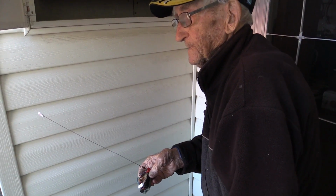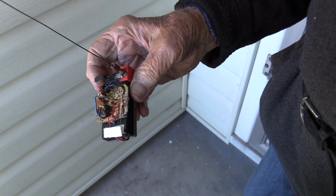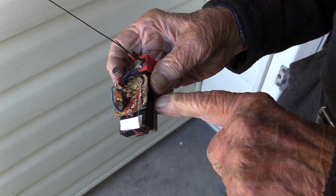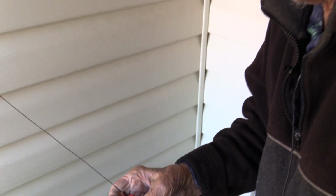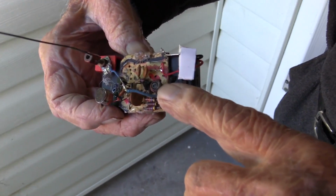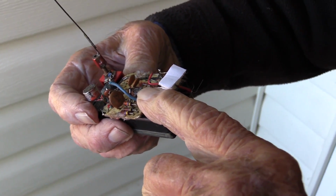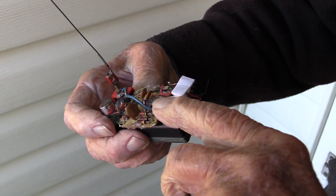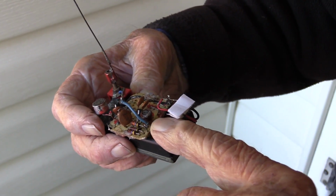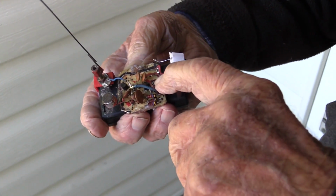It was more or less for educational purposes, and I'm working on 2 transistors. And what frequency is that transmitting on? It was around about 90 megs. You see that there? There's a coil, there's about 3 turns in that, and the tapping on it, it's just like an auto radio transformer. With the tapping on, and it's got the condenser next to it.